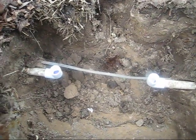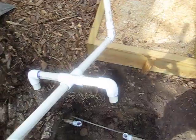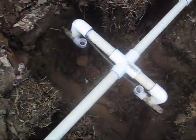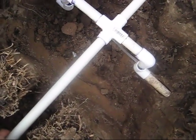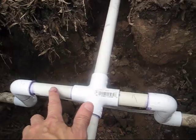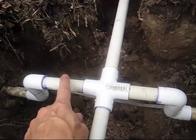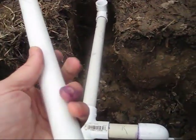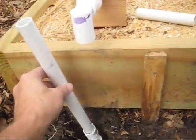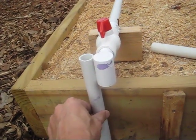What I did is I went ahead and cut into this pipe right here, put two 90s on it, and then I made this here where the 90s come together, and this will come down and fit right on top of that. This is all three-quarter inch 200. I'm not using Schedule 40 underground, but I am using Schedule 40 to come out of the ground. This pipe here is going to go right here, and that's Schedule 40 — in case it gets bumped, it's a lot sturdier.